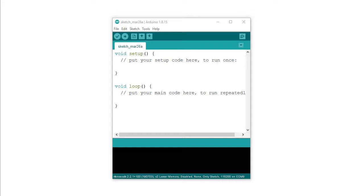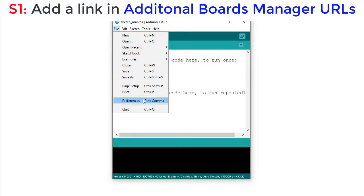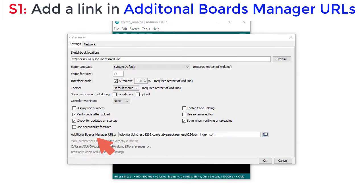Now running Arduino IDE. To use the ESP8266 board with Arduino IDE, we need a few settings. If anyone is using ESP8266 for the first time, we need to do the following setup. First, in Arduino IDE, go into File > Preferences. In the field for additional boards manager URL, we need to add this link, then click OK.